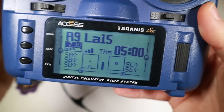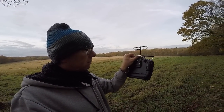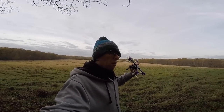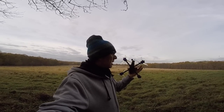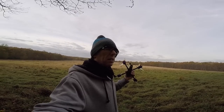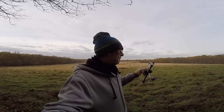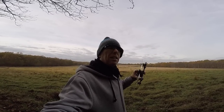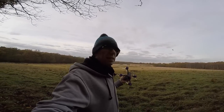So that's about it for how the module works or doesn't work — let's actually fly this thing. We've got the R9 and the R9 ML Lite Pro here. I haven't flown this yet. For this flight I intend to use flex first to make sure it's all going. Don't forget I'm using 868 MHz but with antennas tuned for 900, which should give some losses. The 915 antenna is actually shorter than a 868 one so I can't just cut it down — but we'll see how it goes.